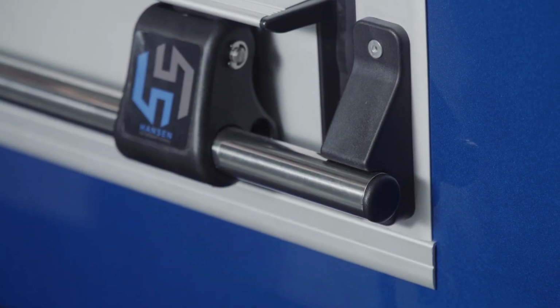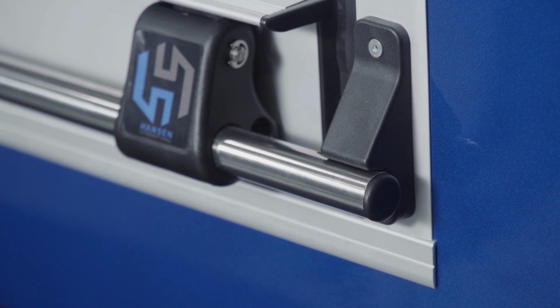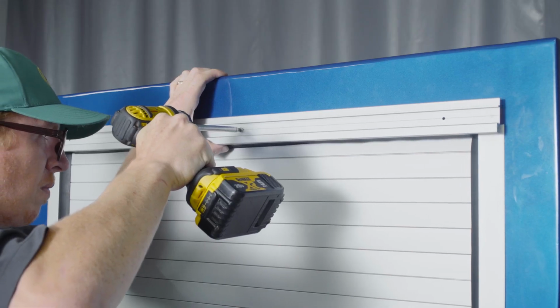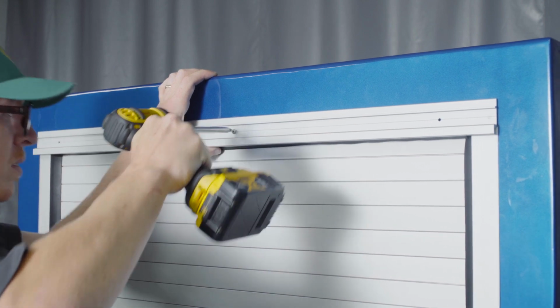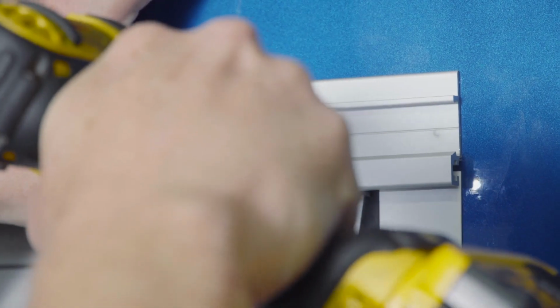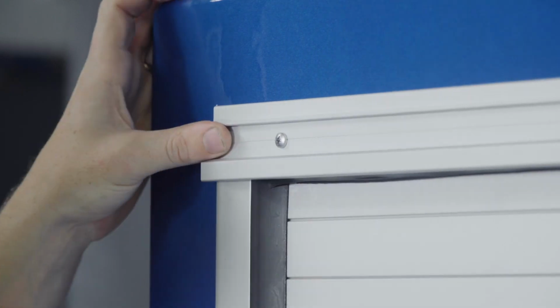A groove for locating drilling points is provided in the drip rail. It is recommended that this be done using drill bits with stops on them, and that the door is closed and latched to ensure that the bit does not scratch the visible face of the door. Drill starting holes for a 3/8 inch long sheet metal screw. Number 8 sheet metal screws are recommended. Screws longer than this may damage the seal or scratch the door. A spacing between 12 and 16 inches is recommended for fasteners.